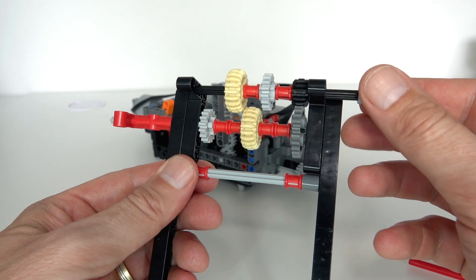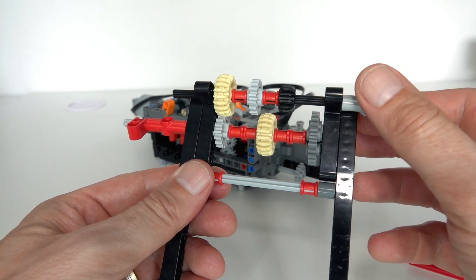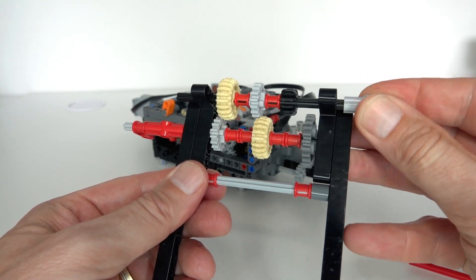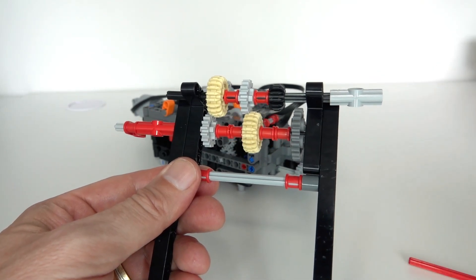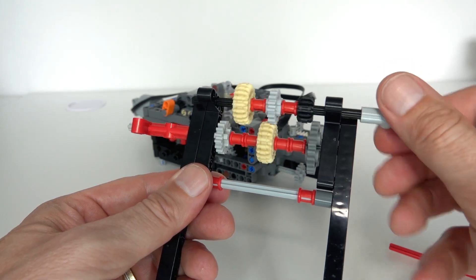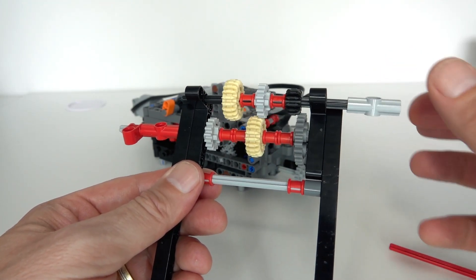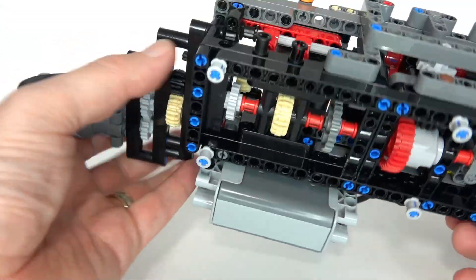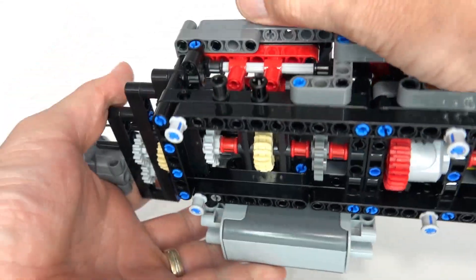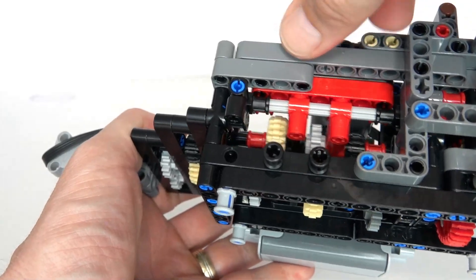Because the servo motor operates in those exact 90-degree steps, we get quite a clean transition, because this really has to be lined up precisely for it to work well. If it's kind of in between the two gears you'll get a crunching, and you obviously can't engage all the gears at the same time and expect the output to rotate correctly. So it does have to be at those exact positions to work well.